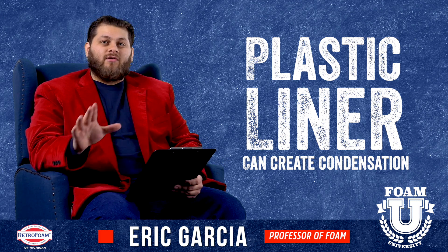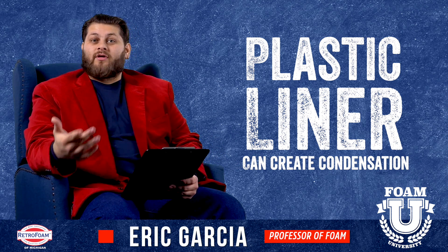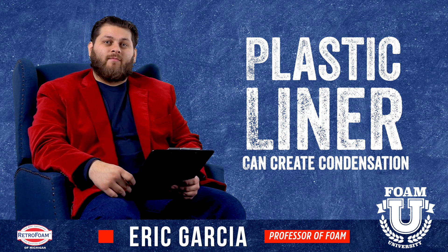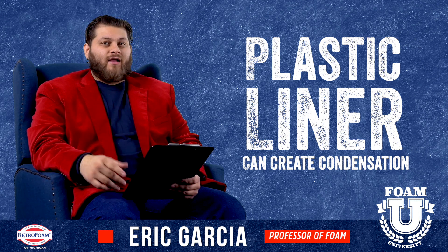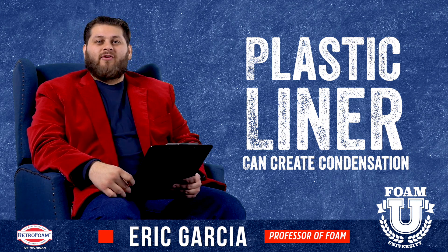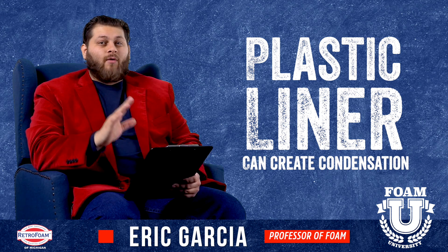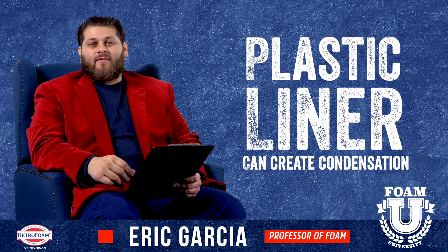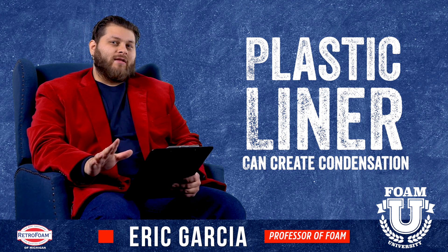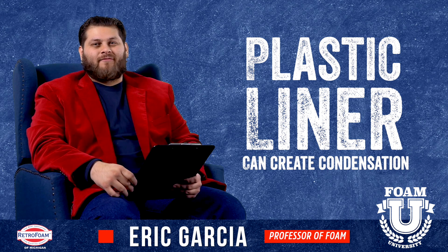It's kind of a pro and con situation, so you'll have to determine if it's worth it for you. Is the metal siding on your barn something that you're looking to replace relatively soon? Maybe in that case you want to put some plastic sheeting up and have that sprayed instead of the metal. That's probably the only situation where I would actually recommend that. When it comes to rust in a metal building with spray foam, it's really not something you have to worry about, as long as you have an experienced contractor who's using a premium spray foam. I would not usually recommend putting up plastic on the metal before it's sprayed, unless you know for a fact you're going to be replacing some of that metal soon and you also cannot wait to get the foam in place.